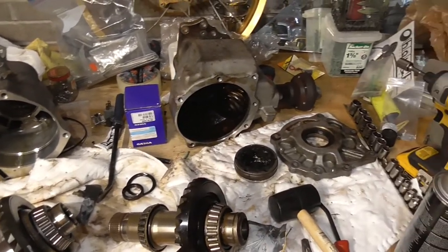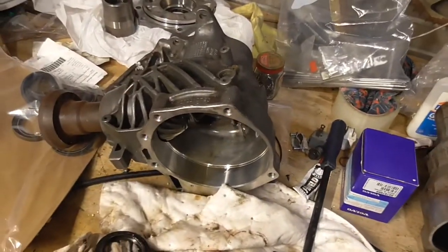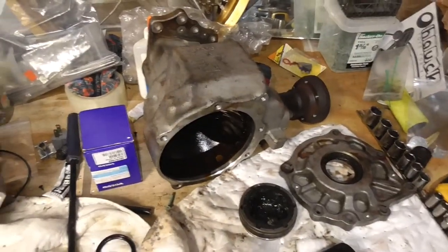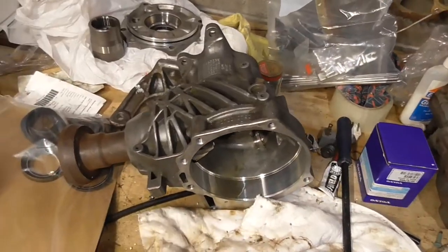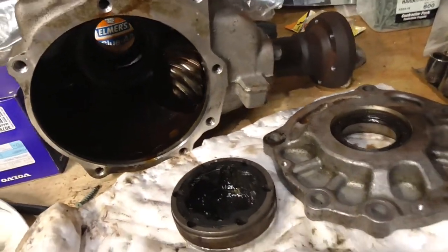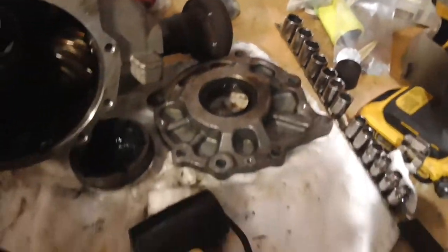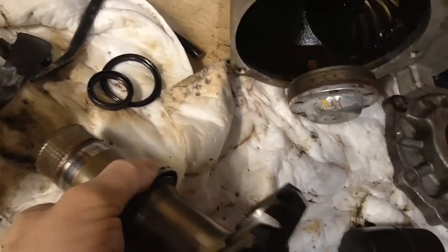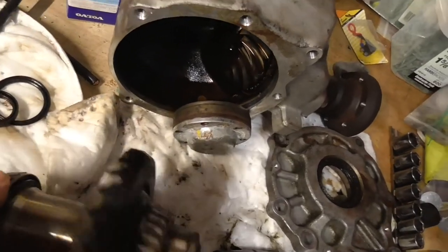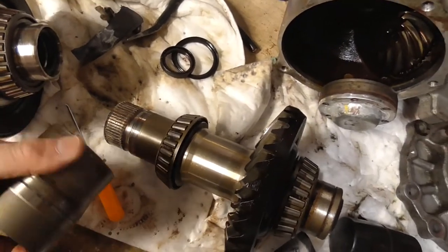Here I have two transfer cases or angle gears out of a Volvo XC90. There are two different styles as you can see by the cases, though it looks like the fitment will be the same. The problem with this old one, which is super dirty and looks like it's been worn out, is it has worn down shaft splines so that my transfer case collar slips on it.